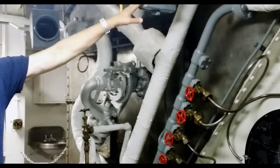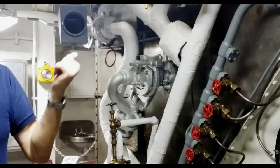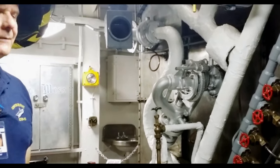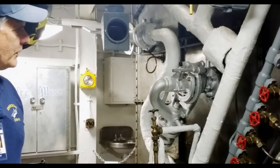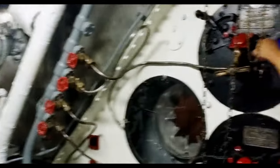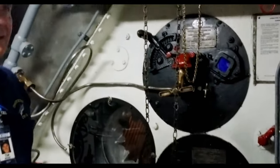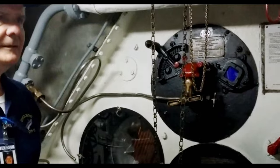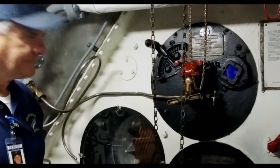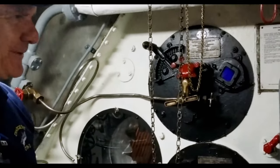The scopes are there to see what the plume looks like. In addition, they usually had somebody stationed up top watching the plumes and reporting back. You also watch the color of the flame using these sunglasses over here. If it's too orange, you'll probably be burning black smoke. If it's too white, you'll be burning white smoke. There was a golden color you wanted to keep it at.